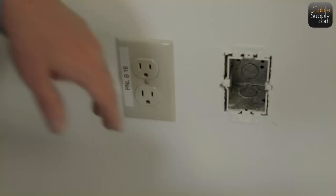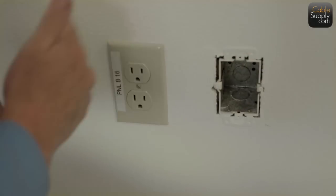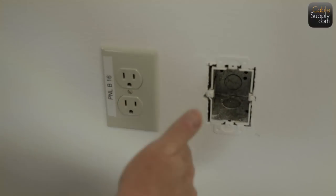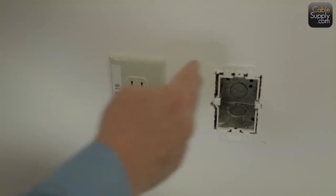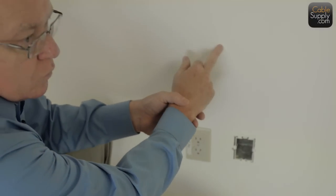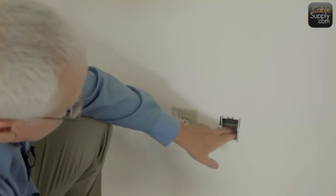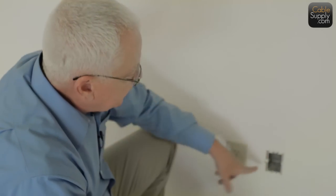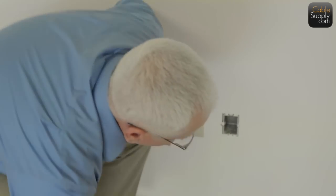Notice it's close to the 110 block, and right here is your beam, so that it's being separated. You always want to pull your cable down into a different area than the 110. So the 110 is going up this way, the other cable is going up this way, and you have a metal wall going right here. But again, this is what you want, and it's going to have conduit going all the way up to the top. Fairly easy to shoot a cable down there, but you want that on a firewall. You don't need that anywhere else. So just go look at another jack over here where it is not a firewall, and you'll see the difference between the two jacks. Let's take a look.